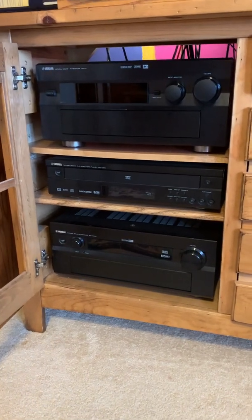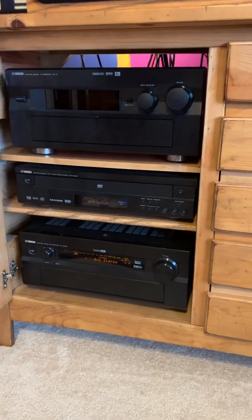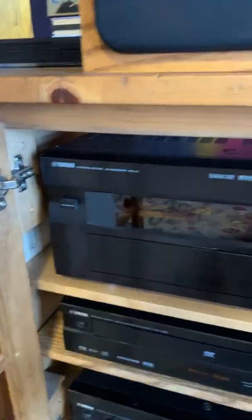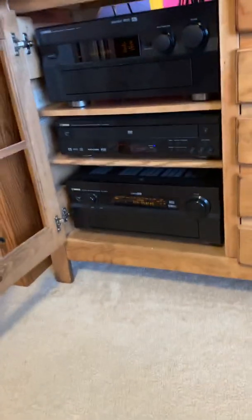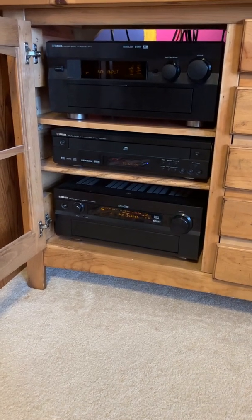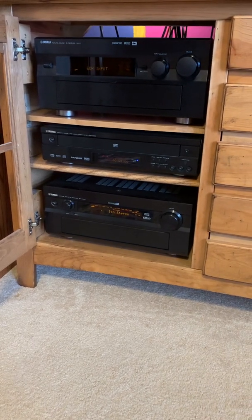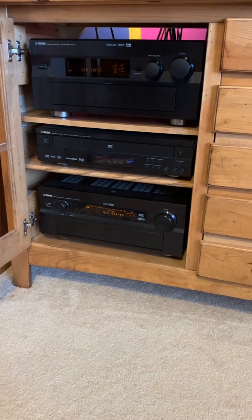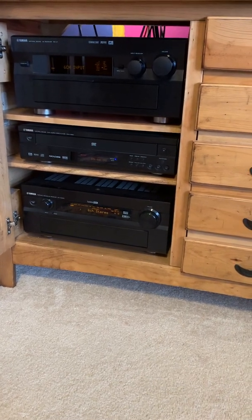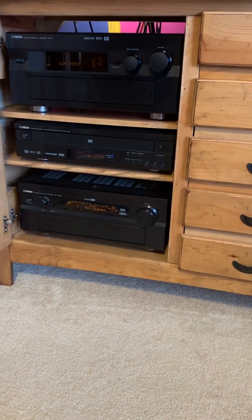So what I ran into was I can just power it on — you can see how just the RxV3300 came on. I actually added some tape over the V1 because trying to power these on at the same time is causing too much of a load on my breakers. I trip my 15 amp breaker occasionally when I try to power them on together. But if I fire them on separately it's no big deal on the breaker — they run fine. It's just that startup inrush of current that can trip the breaker.